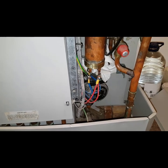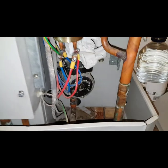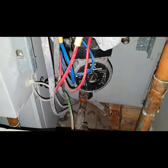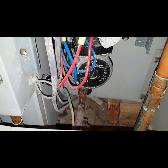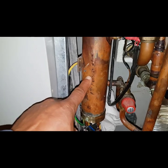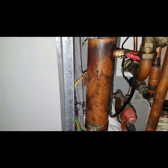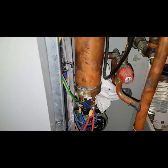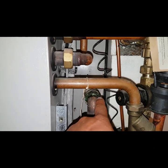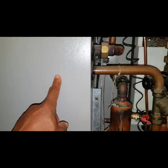What we're going to do as well is check the pumps. You've got three pumps on this boiler. The bottom one here is the primary pump — what that does is pump the water into this heating element, because that's basically like the boiler. It gets hot, heats up the water, and the pump pushes it out into the thermal store, basically heating up the thermal store.